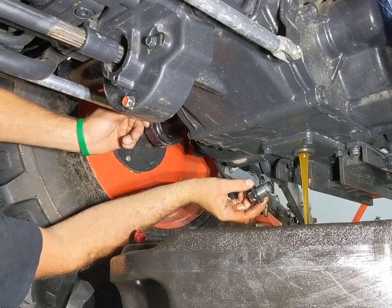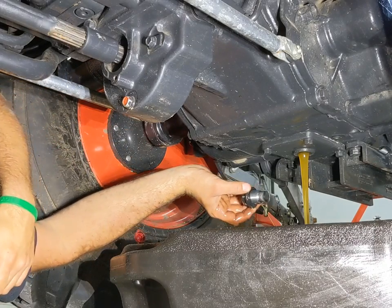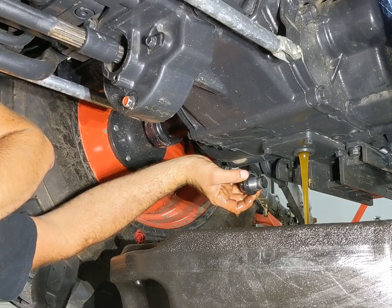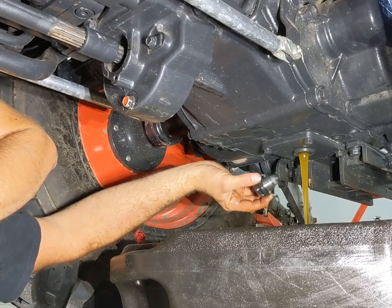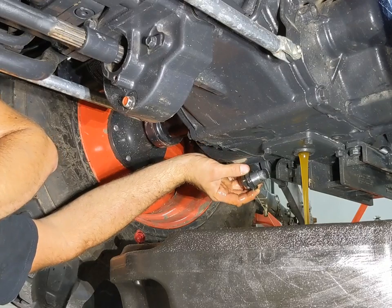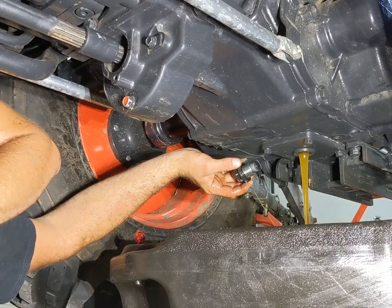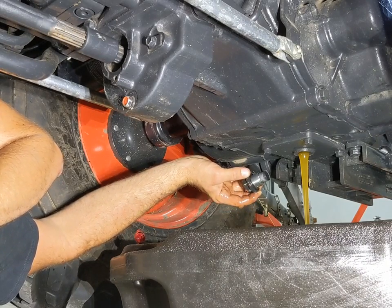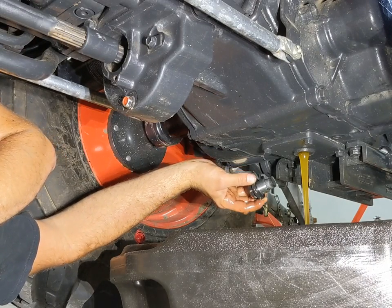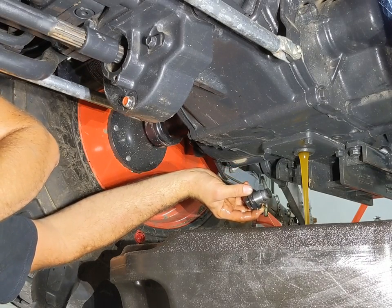The week prior to the snowstorm, I had gone out and drilled the ice. I've got an inch-and-a-quarter drill bit that I use for punching holes in the floor of our house, 16 inches long. I had all but an inch and a half of it to get through the ice. Every other chart in the world tells you that 14 and a half inches of ice is just about adequate to put a tractor-trailer on — well, apparently it's not enough to put this tractor on. About a week later and one 36-degree thaw in between, the stream running through the pond eroded enough ice that on my fourth or fifth pass plowing snow, it broke through.